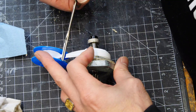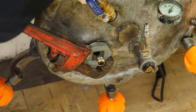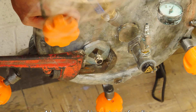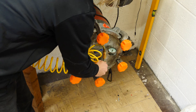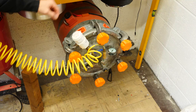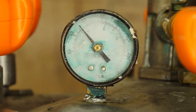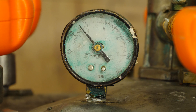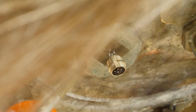I'll put a little Teflon tape on the threads in addition to the gasket that's already on there and get that back onto the tank. Let's test this out — put some pressure on it and see what happens. Looking good. That's holding at somewhere between 50 and 60 PSI. I don't know how accurate the gauge is, but it's holding pressure. It's working. This pressure tank has the ability to be heated and we're testing it under pressure with heat, and it holds air no problem.